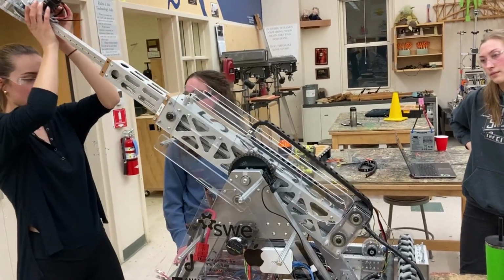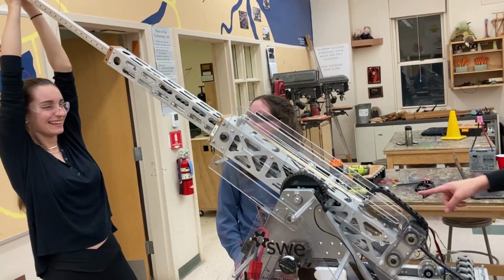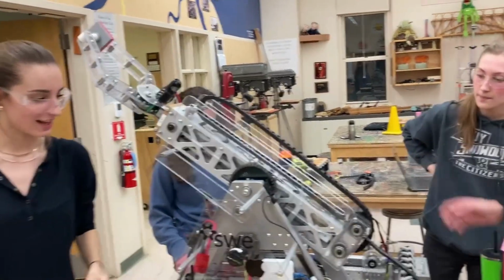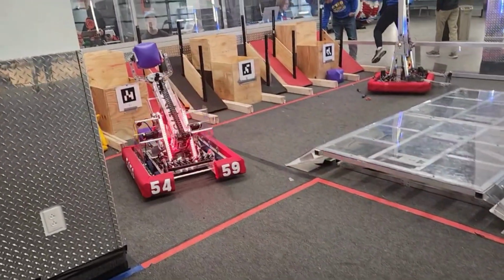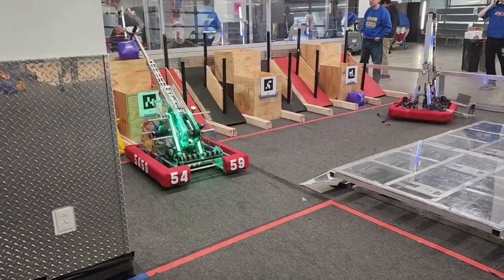The energy chain loops around a shaft and pulley, and constant force springs pull the shaft back to the top of the track when they are not being pulled against by the extension of the arm. To test the arm and practice our scoring cycles, we took a trip to WPI's practice field. As planned, our finished product reached the mid and high node levels.